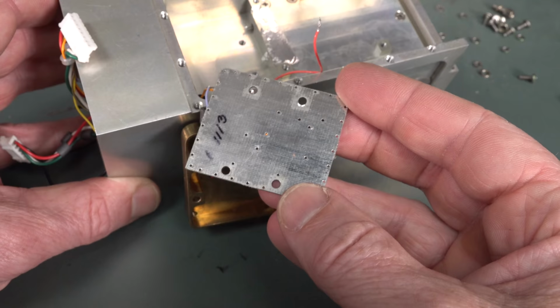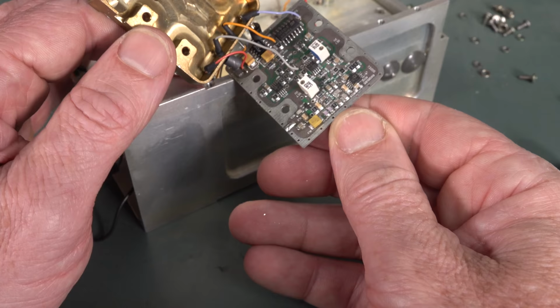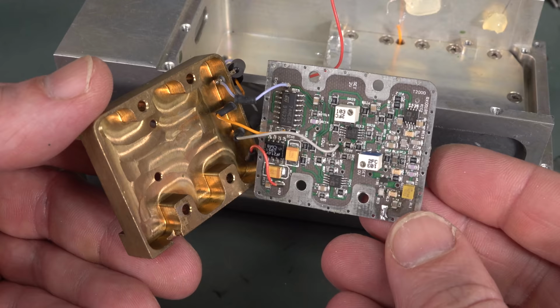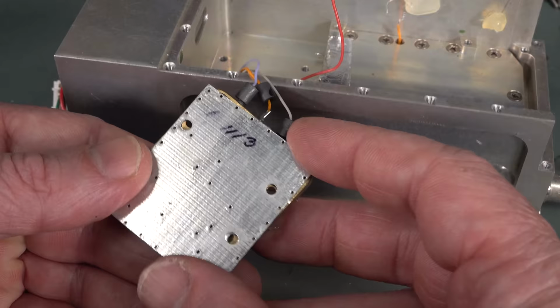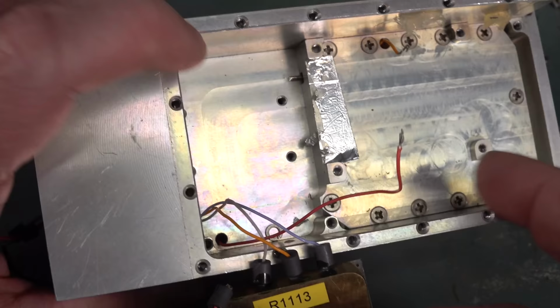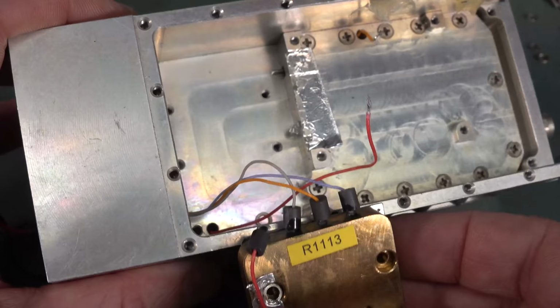Of course, that could be a multi-layer board. I don't think it is. I think that's a single layer jobby. There it is for those playing along at home. Capture that in 4K. But yeah, you can see the serious RF engineering, the typical cans. I might have to link in a good spectrum analyzer teardown on stuff like this. You'll find these individually shielded modules on controlled impedance boards with penetrators, the go-to thing for getting signal and power between modules.